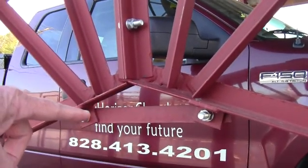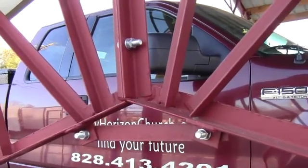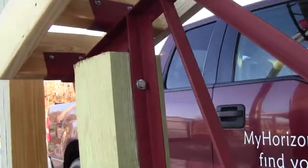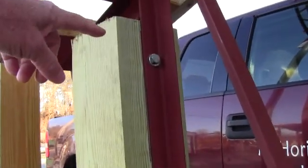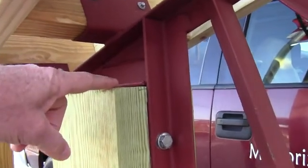And then it's got the stabilizer bar right here. That comes separate — you bolt it right there for the stabilization of the truss for the snow loads and the wind shear. And then also, as you can see on the post, we've got everything where it just — let me give you a little bit closer look here — sets right on top of the post here.